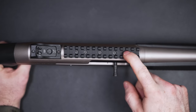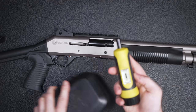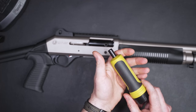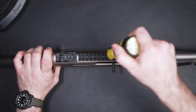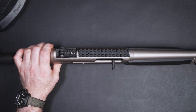In fact, I think I was able to get these out with just five inch-pounds of torque. So if you do pick one of these up, one way you can test these is with these Wheeler fat wrenches — I'll have links at the parts list. The cool thing about this torque wrench is you can loosen as well as tighten. Put the flathead bit on here, set it at about 10 inch-pounds, and test each one of these screws to see if they're too loose. I haven't seen anyone test them where they weren't too loose.